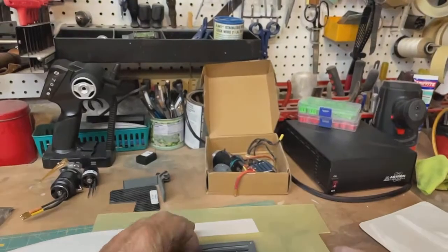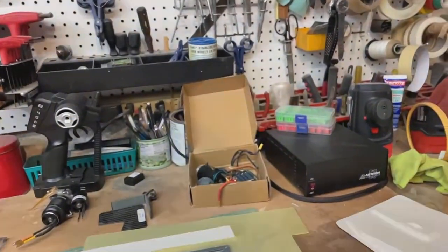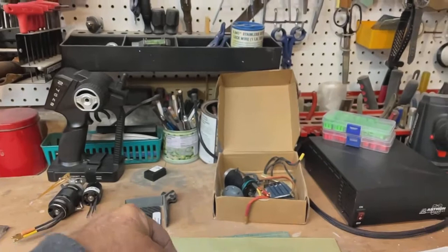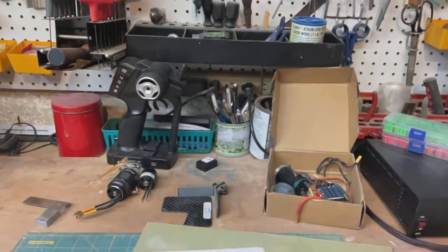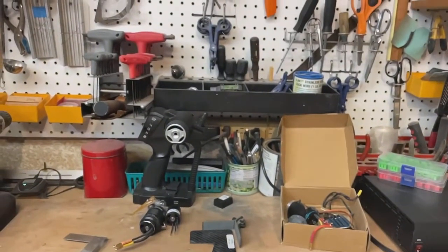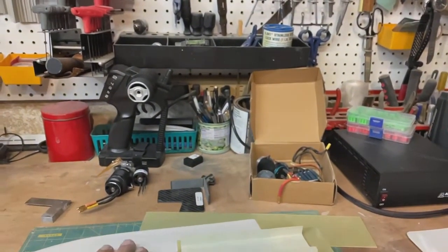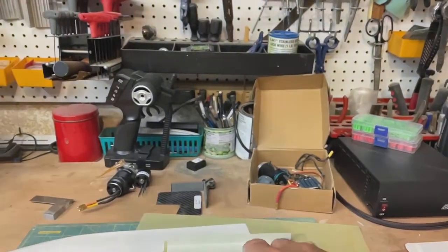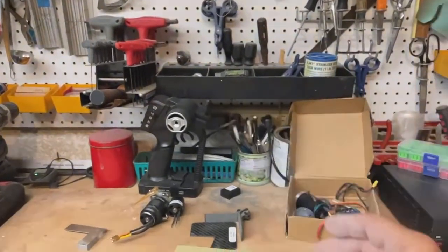Then I talked about making an aluminum channel. Here's what I'm planning to do — imagine this is made out of aluminum, and I cut a hole out of it to match that. This piece of aluminum would go underneath here like this, so that adds a stabilizing fin. The design of this boat actually follows the cracker boxes of old days, which needed a center fin to turn because being a real flat bottom they would slide sideways — same thing with a jet boat. So this will serve to protect this grate from rocks and whatever, and also serve as fins.